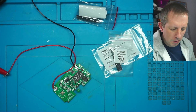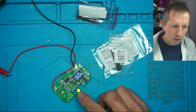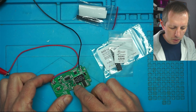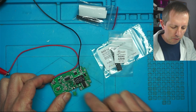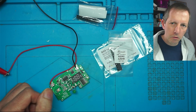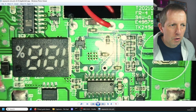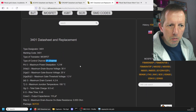I'm looking at this skull shaver again. If I apply power to it, the LED — which replaces the motor at the moment — is always on. So the component I put in at Q3 mustn't be the right one, or the main IC is faulty. I thought Q3 was a P-channel MOSFET because of this picture, which looks like a 3401, and the 3401 is a P-channel MOSFET.